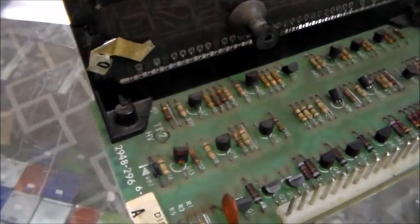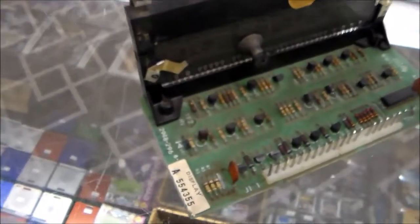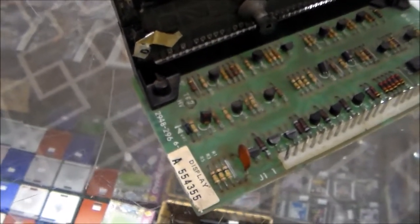And on this machine, it's at 180. So you can sometimes put it down to even like 170. The lower you put it, the longer the displays will last. But the problem is if you go to 170, you might get problems where stuff's flickering a little bit. So we leave it a little bit high, but it's not really high.